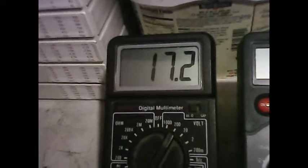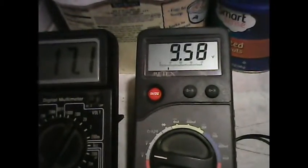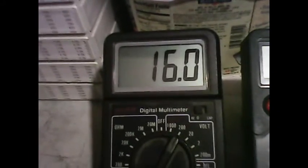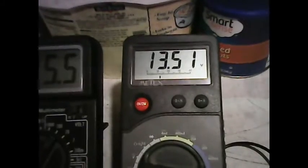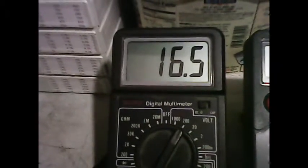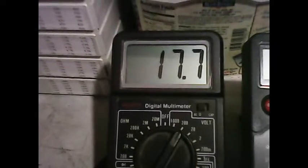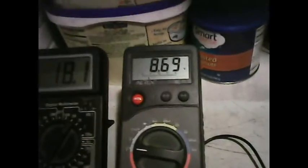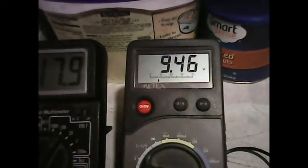as long as the power supply remains around 17-18 volts there, I have torque. If the power supply goes down below that voltage, then I get all kinds of erratic behavior because it's jumping back and forth. So I have to get it to the supply voltage that I designed it for here, which is 18 volts. And now I have the proper voltage across the motor for torque.